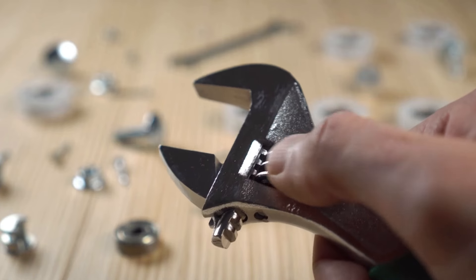You want to have a crescent wrench — this is going to be very important for adjusting fixtures. When you're setting up your machine, you're going to be using this to tighten down things. We've got a couple bonus tools. A file is going to be a big help to you, especially if you are trying to do a lot of things without carrying a lot of tools. Soapstone — sometimes your program will give you some, but if not, it's not that expensive. You'll be able to write on metal with this and it won't be a permanent mark.